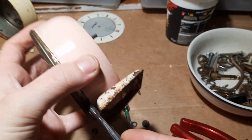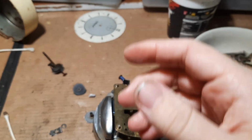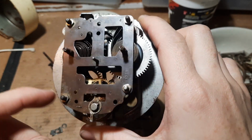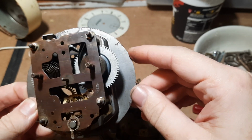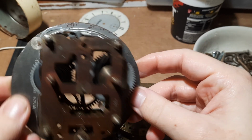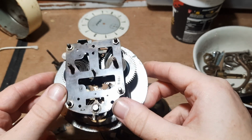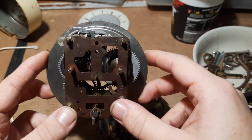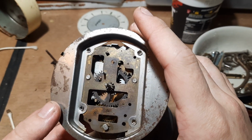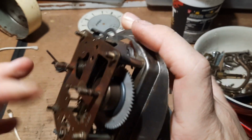So yeah, sorry to jump the gun a bit, but I've already serviced it. Well, I did that on camera, but I've already reassembled it. And my finger was on the balance wheel for a bit. It's running very well. It had run from last night to today, so about 20 hours, non-stop, perfectly well, been oiled. I did use some parts from the donor, and you might think, well, why not just use the whole movement from the donor? Well, here's the thing, because I'm doing some research on these, I like to keep what's in this movement as original as possible.